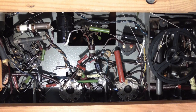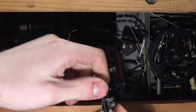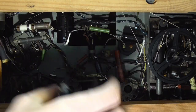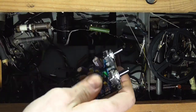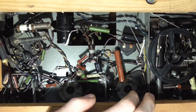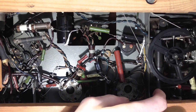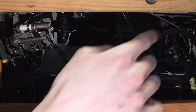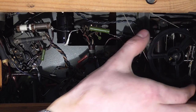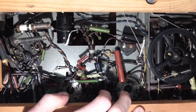And that's a problem because the tuning on this thing here is made through a potentiometer which is doing a half revolution from fully open to fully closed. So, in order to neatly cobble this thing together and link the tuning of this to the tuning of this, we'll have to go with some kind of a contraption to reduce the amount of rotation down to a half revolution. Now, we could go onto this large wheel here and make a reduction, but that means that the other wheel would have to be even larger. And, well, I mean, I could put one right here, but it would be blocking most of the view.